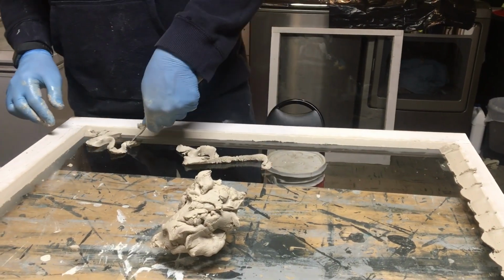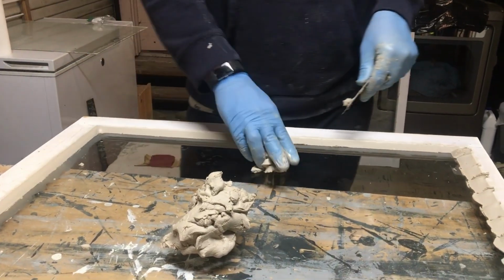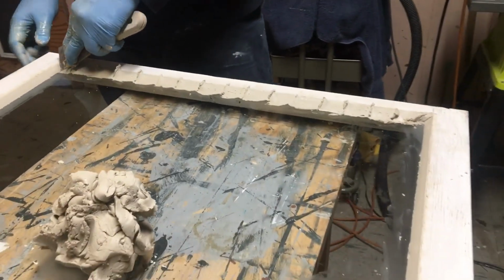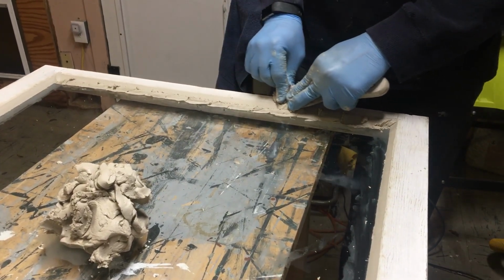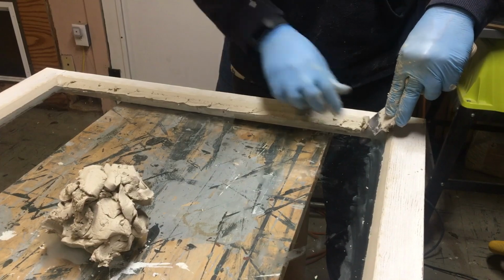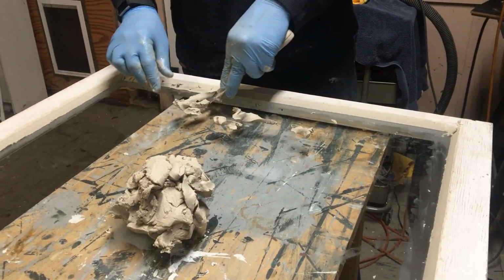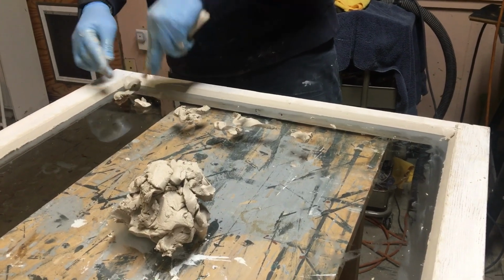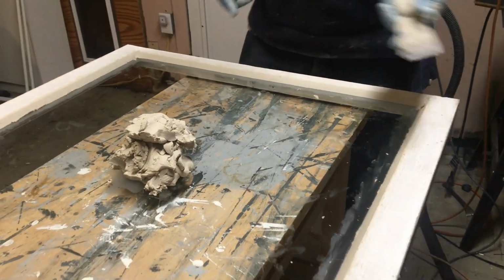And again, this is the sash where we left the glass in the window. Theoretically this is the harder of the two sashes to glaze versus the one where we took the glass out and cleaned it. But as you can see, it is 98% the same glazing-wise, because you got rid of all the old nasty glaze. Even if some of that old glaze is still on there, as long as you get most of it off, it won't make a difference. Once the glaze is on, you can't even tell the difference between the two sashes.